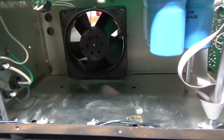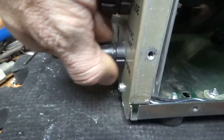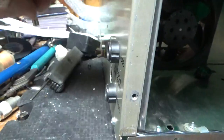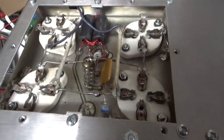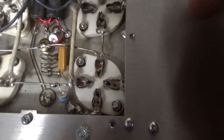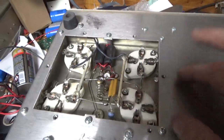I'll be back — stay tuned. I'll have to change the line fuse holder because it just spins around and around. The other one's fine. You can take the fuse out and that's not what's causing it — it should stop. Back to work. I changed the two gas discharge tubes. Someone already grounded the grids; I left that alone. I compressed the socket clips carefully. That's all set. I'm going to put a different screw in — it's nice and tight. I'll put the cover back on; I was missing one screw or so.